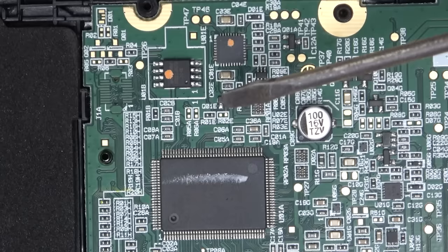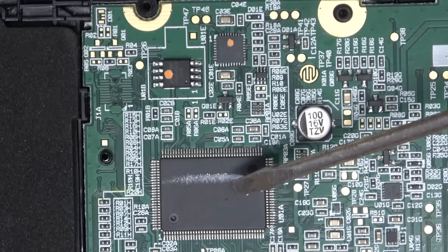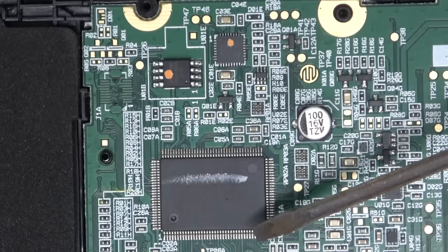What I'm guessing they're doing, I'm going to dig in here and try to figure it out, but I think they're probably sending Python command lines over to this via SPI, and then it's sending the responses back. It could also be formatting the responses into TI Basic or something that the main CPU could run, because apparently the performance of this is pretty bad.